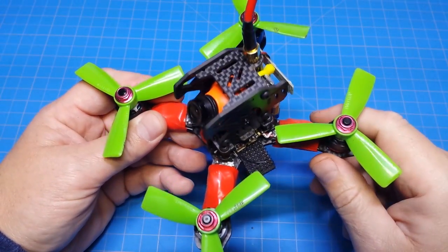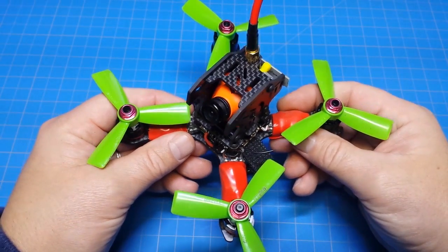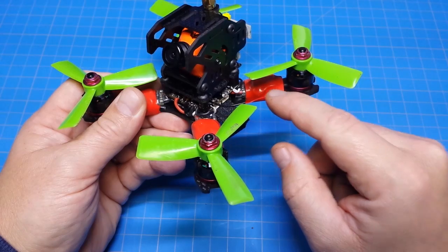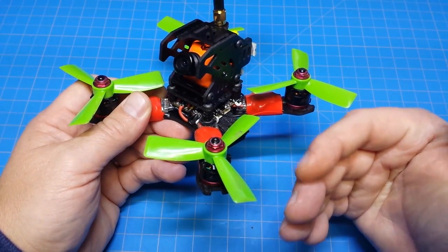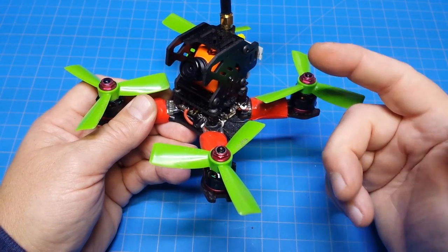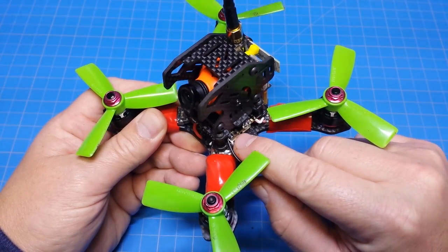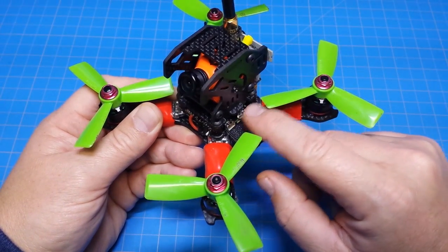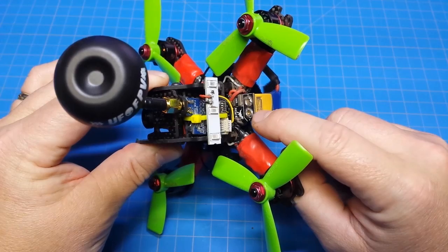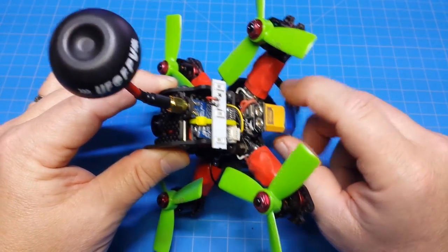As for the board, I enjoyed wiring that up — it was nice and easy and really streamlines everything, keeping your profile nice and low. One commenter — I think it was Matt or Mike Mueller — mentioned that friends of his who race these have seen the OSD reset with high amperage draw. I haven't had that experience, but I'm only running 3S, so take that into consideration. I did lose video once, but I couldn't say why. I also had a buzzer on the side that got ripped off in a crash and tore the voltage-plus solder pad right with it. There are several versions of this board, and if I were to do it again I would get version 3.1 — the one with solder pads rather than XT60. I think Banggood is now only selling version 3.1, which is a good thing.